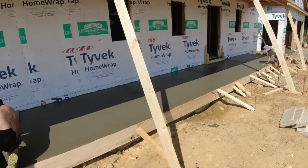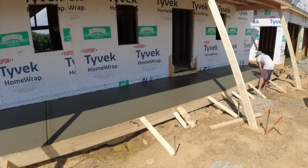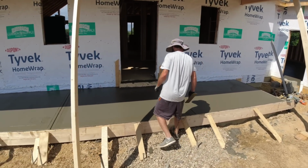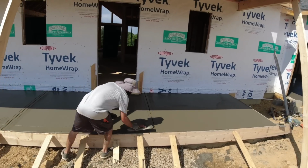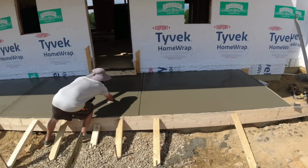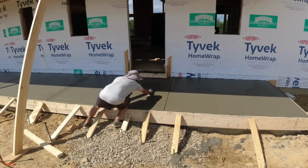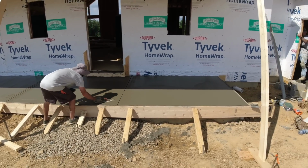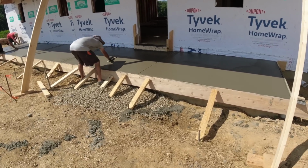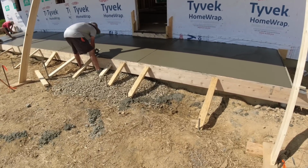And what we like about this is we didn't want to cut running into that sill. If you don't do anything with it, a crack could go through that and up through the sill, so we'd have to saw cut that or tool cut that as well. So we just like to avoid it. Tom's refloating. We'll open those up, clean up the whole face.